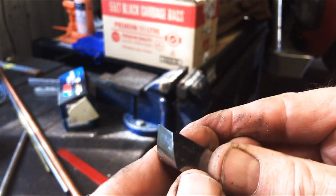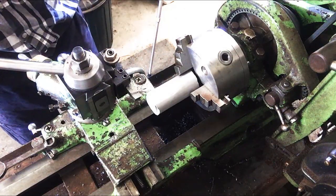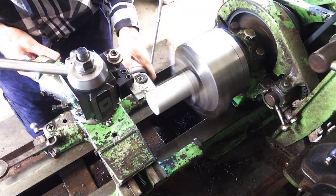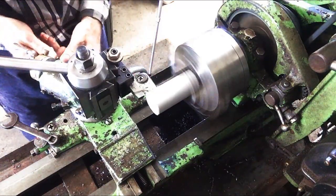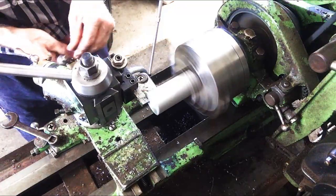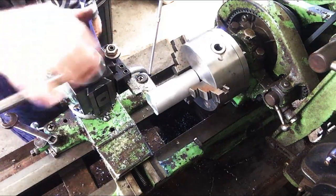You can just see it shines up the edge there a little bit. Let's go over to the lathe and give that a go. Here is the turning and facing tool we made the other day — we're just going to use that to face off this face and turn down a little bit just to clean it up. Just a touch above centre there; I could feel it when I got to the middle.